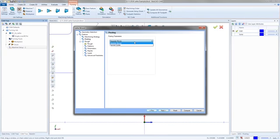So we've got separate moves and canned cycles. This pops up all the time, this stuff not working. The big thing with this is not many of the posts by default have all the canned cycles in them. Some of them might have a few, but not every post we create has all those canned cycles. So if you are trying to use canned cycles for this stuff, you have to get in touch with our posting department, and they'll be able to go in and set up the canned cycles for you. All you need to give us is an example of how they're being used, and then the description of them. You can usually find that kind of stuff inside your manual, or if you're lucky enough to be able to search online or call your machining dealer, then they can usually provide you with some of that information as well.